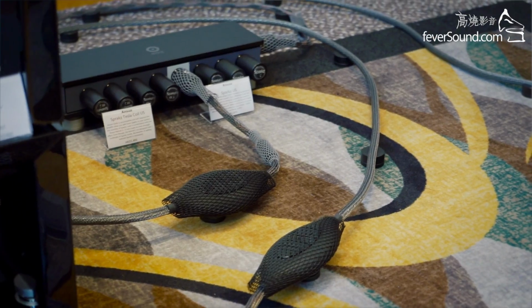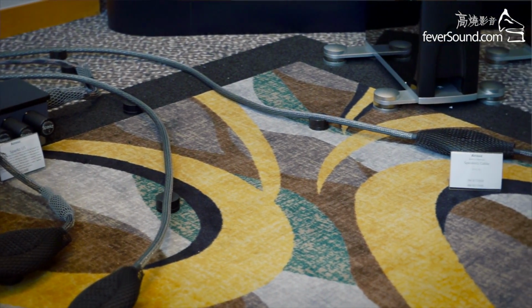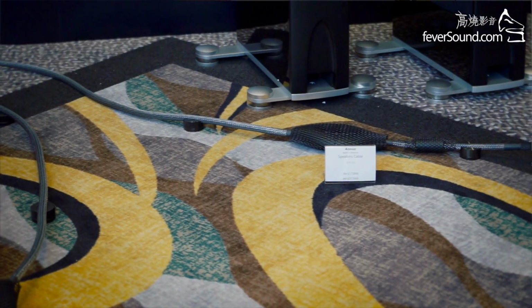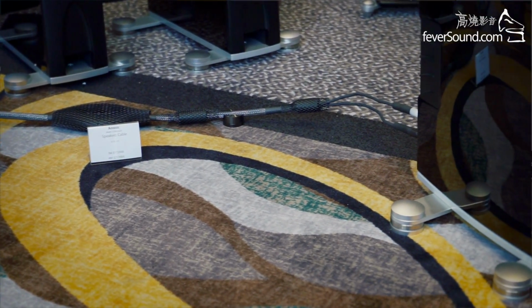In the higher range, we wrap them in clockwise and counterclockwise spirals, and because of that, and still being very close together, they tend to cancel all inductance. So when you go to the DTC, that inductance is only 1/3 of what you see in the X. So from low to extremely low.